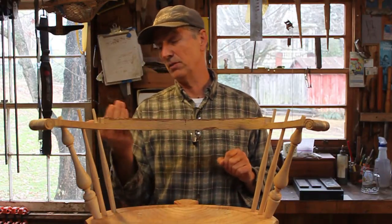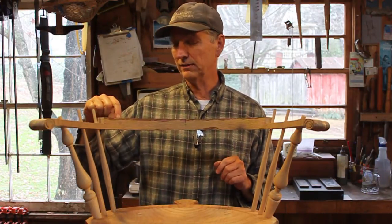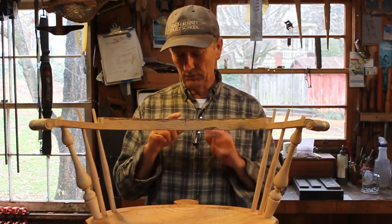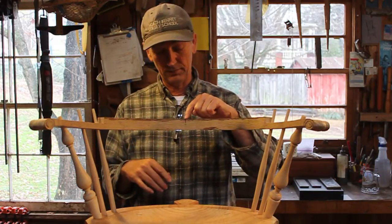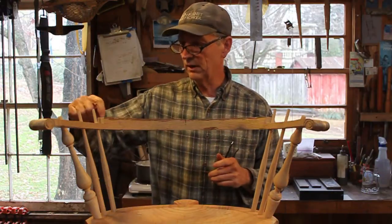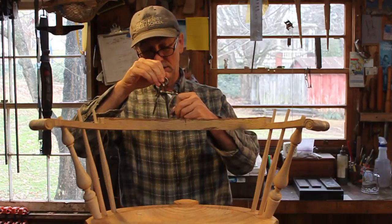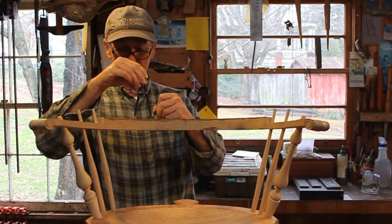I've got to get it back towards the back as far as I feel comfortable with. I'll be about 3/8 from the back of this, and hopefully that will give me an 1/8 inch or so — or at least a 1/16 right there. I'm going to drill them 2 inches on center. We found our center previously. I've got my line drawn here, 3/8 from the back, and now I'll just take this at 2 inches and lay out.